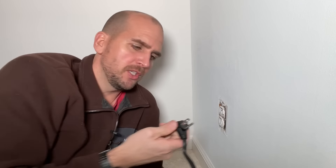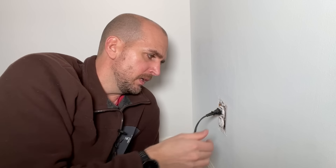This is usually not as common if you have a three-prong plug. Usually that ground plug provides a little bit more tension to hold into even a worn out outlet, but if you have a two-pronger, really even the weight of the cord wants to pull that plug out of the outlet. Now this can obviously be a safety hazard because you start to expose a connected hot side piece of metal — the blade from that plug — so that is a big safety hazard and also just a pain.